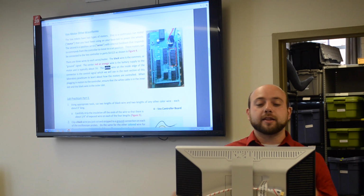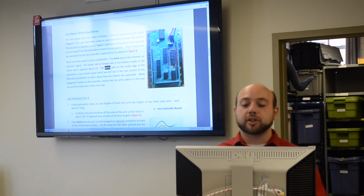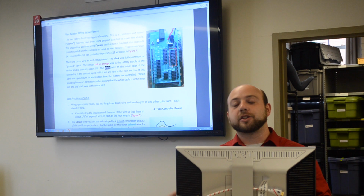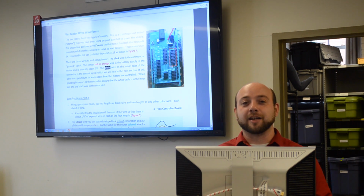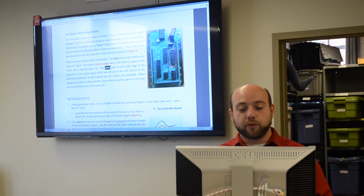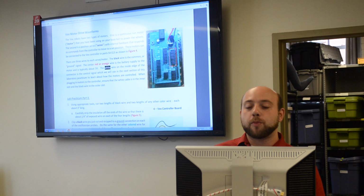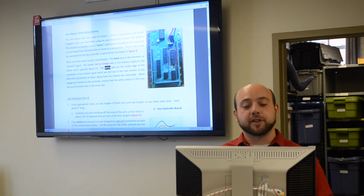The one thing that it noticed that is written in the lab that I would like you to do slightly different is it mentions basically rotating or changing the servo signal from forward to reverse every other second. That makes it really hard to capture a waveform, so what I recommend is putting one channel on full forward and leaving it there, and put another channel on full reverse and leaving it there. And that way you can measure the signals.